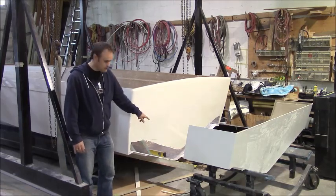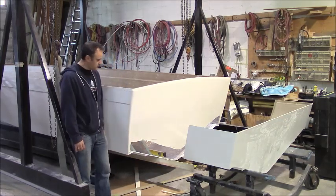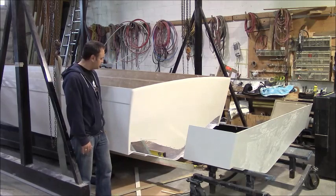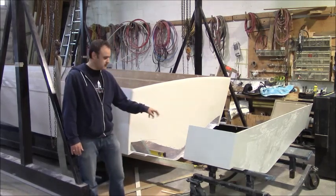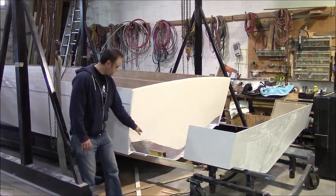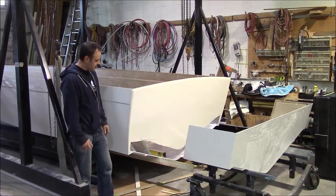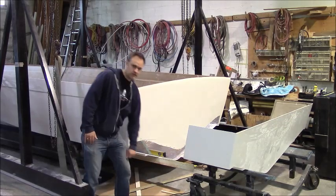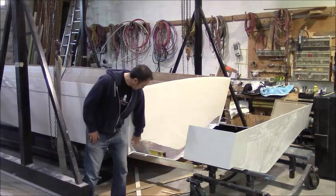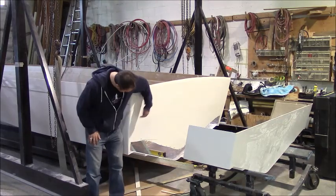What Hector's done is he's screwed some straight edges to the bottom of the boat because we want to keep the bottom fair between the two pieces. Now how this piece is designed — it has a flange on the end that will actually sit on top in here. So we fit it all nicely and it will get pasted. This flange here is going to get pasted on and then glassed all around. We've only cut enough just to do our work for now, but eventually it will be cut much higher.